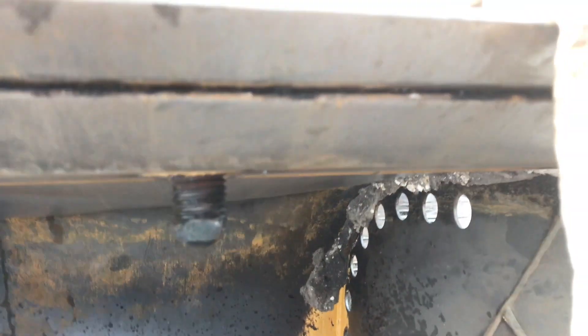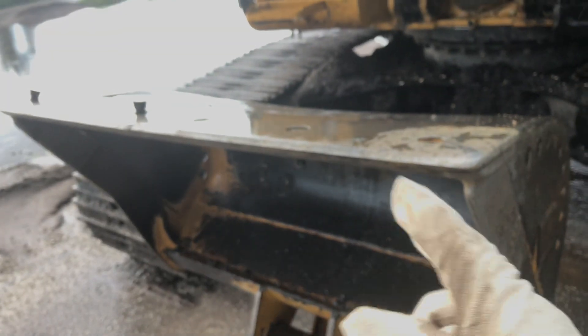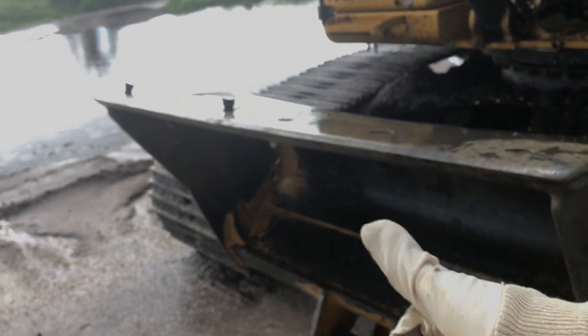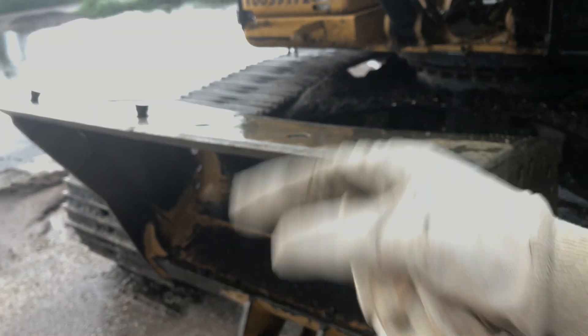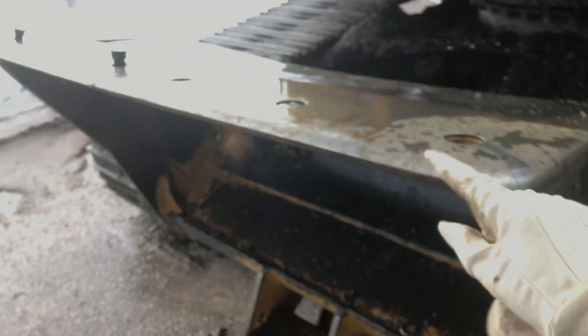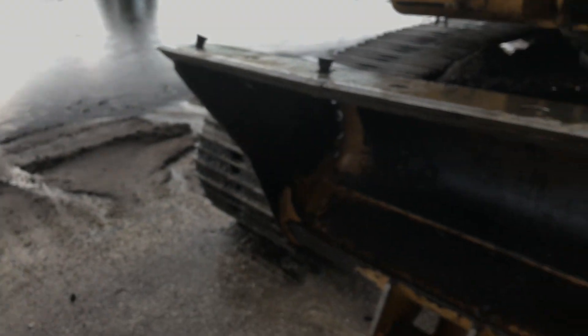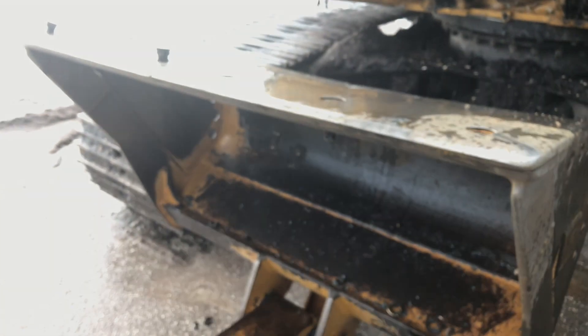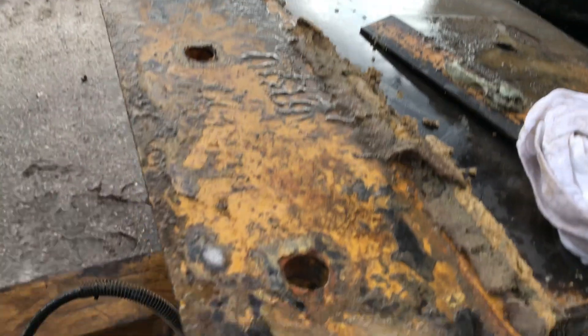There you go, last two cut. This is kind of perfect that it's sitting like that. You hit them with a hammer, take the bolts out, pull this off, and then you clean everything. Because if you get dirt in between this blade and this, I don't care how big your gun is, you will never get that thing tightened. So go ahead and do that.